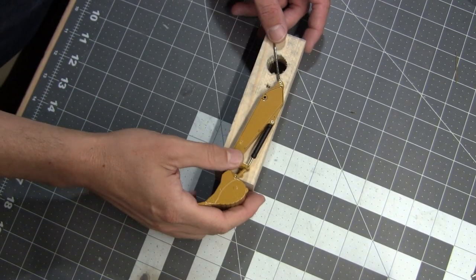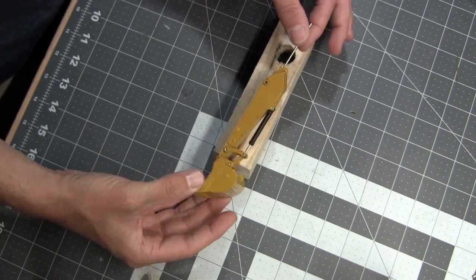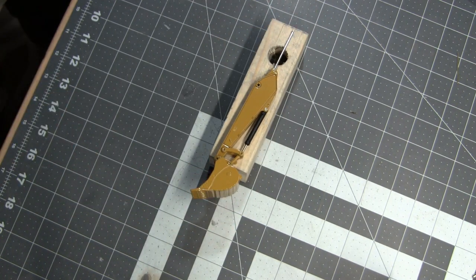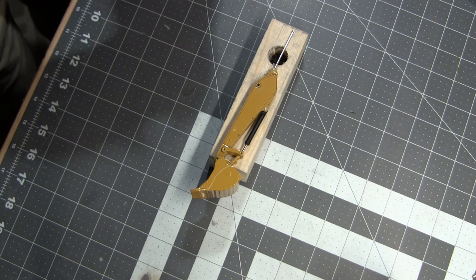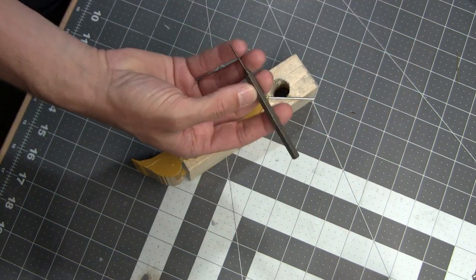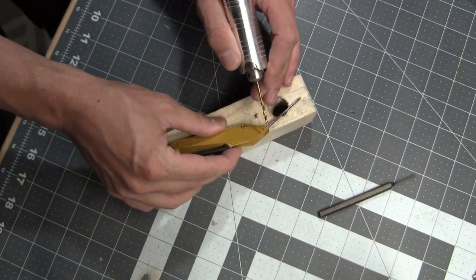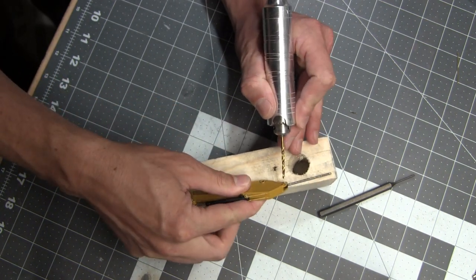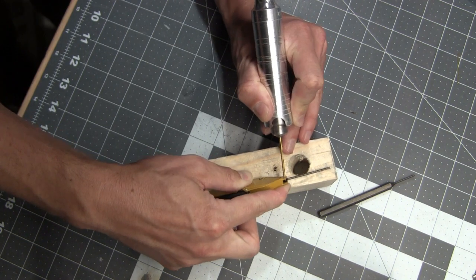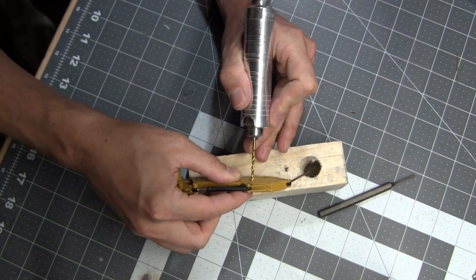Alright, before we get brassing around in here, we need to disassemble the OEM stick because there's some stuff we need to take off this that is going to be going over to the new project. As I learned previously, and I knew better, I can't just hammer these pins out with the little pin driver here. I have to drill the tops out first, which is pretty much standard procedure for this type of component, but I thought I was cute and tried to shortcut it last time, and it didn't end well.